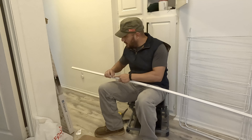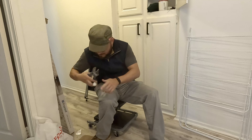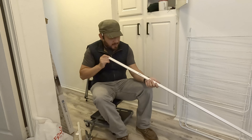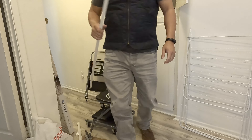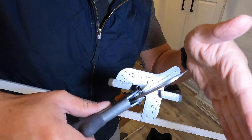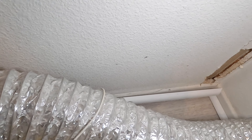So this is an 8-foot quarter round and I measured all 74.5 inches. I overshot it just to give myself some slack and I'll trim down from there — stuff's expensive. So I just set it to 45 degrees and made the cut.